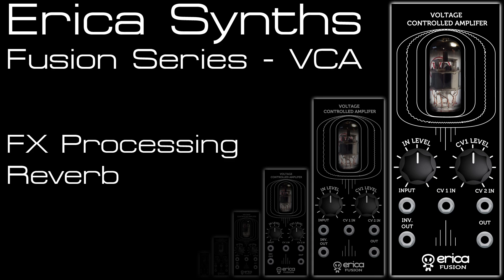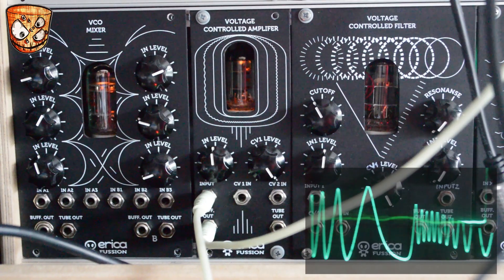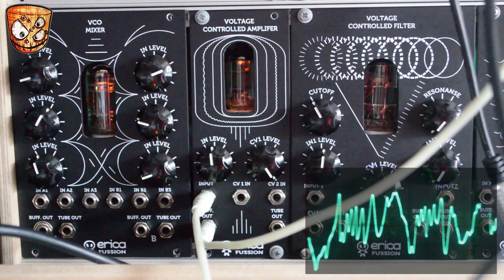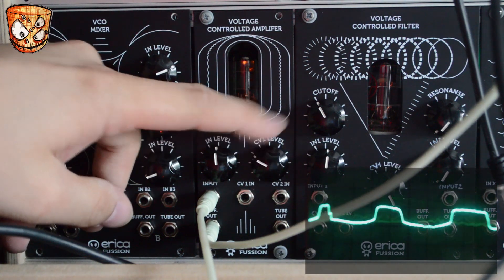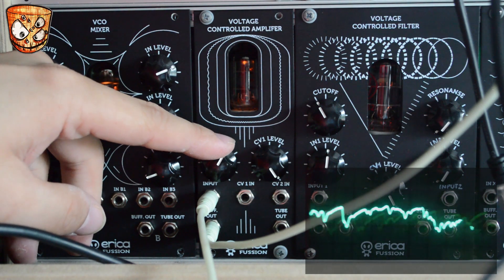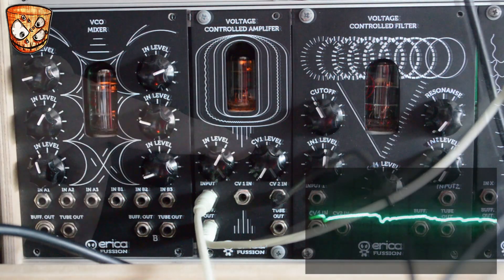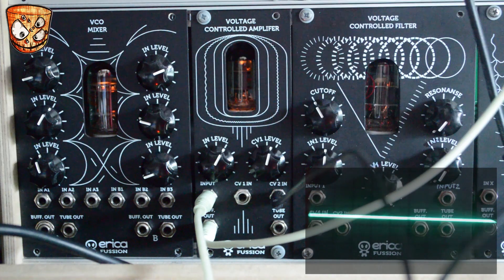Sticking with effect sounds, I've got a percussive patch going again. A mult of the original dry sound is going into a spring reverb, with the output of the spring reverb going into the Tube VCA. CV1 is again an offset and the input level defines how much we clip and drive the output of that spring reverb with the tube — it can go from clean right through to a lot of grit. Plugging an LFO signal into CV2 we can get some nicely moving reverb sounds, and the offset will bring that up more as well.